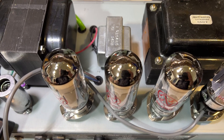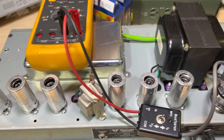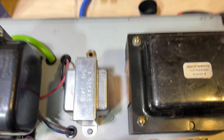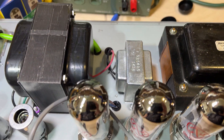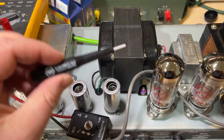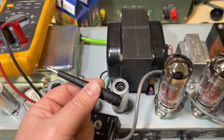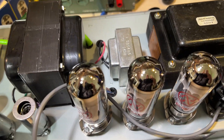Either way, biasing your power tubes is a good place to start if you're interested in amp repair and a good thing to learn about. One final safety note: if you don't have a potentiometer accessible on the outside of the chassis and you're having to dig around inside for adjustments, it's worth investing in a ceramic screwdriver. This non-conductive screwdriver means if you drop it while making adjustments inside the amp, you will not short anything out, and they're relatively inexpensive.